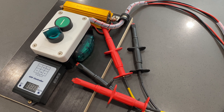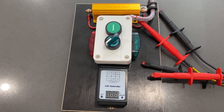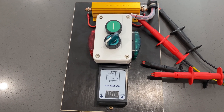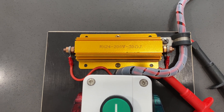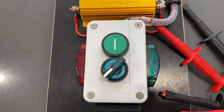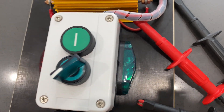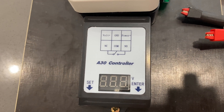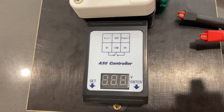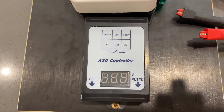To make the pre-charge board I've installed these components on a piece of fire retardant plywood, the same as what's used in the off-grid setup: a 200 watt 30 ohm resistor, start-stop station, some navigational lights — your starboard and your port — and this unit called an A30 controller. It's a voltage sensitive relay, so the relay closes at a preset voltage you determine by pressing the keys here.